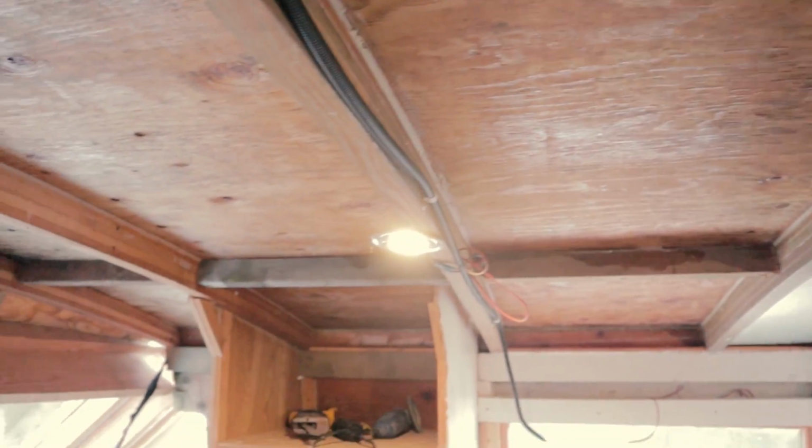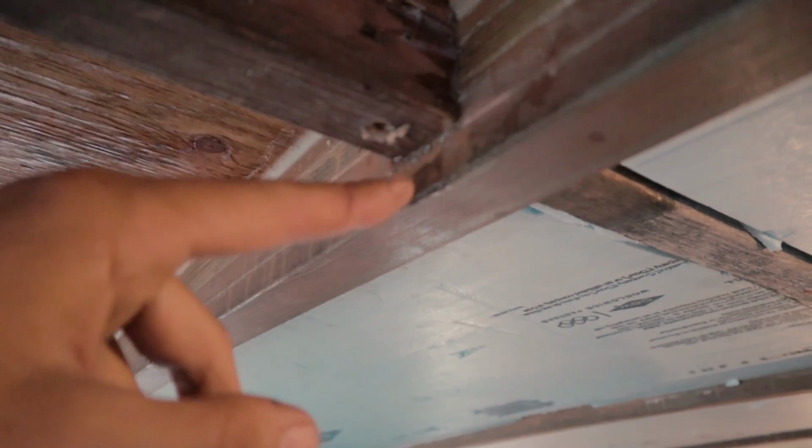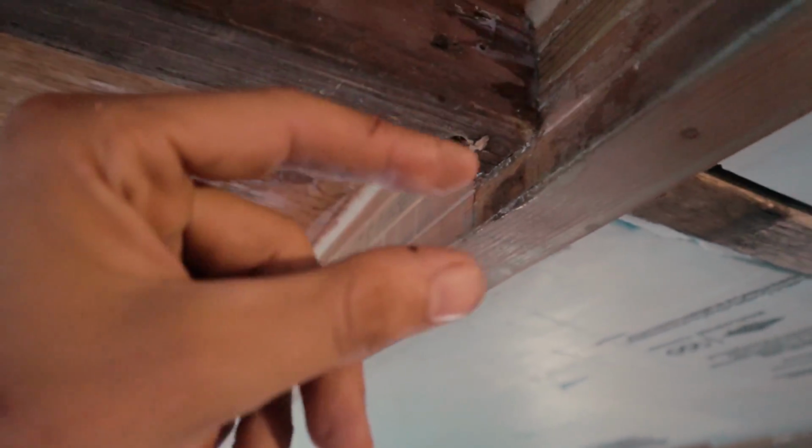Alright, look at that. It may not look like much, but all these little studs all the way across really strengthen the place up. Also, you can see there's the depth that we're going for. So we got the board in, and that's about 3/4 of an inch, so we're taking 1/4 of it to lay the board in here, and then we'll still have 1/2 inch of overextension. And if you think 1/2 inch ain't much, well, let me tell you, it's plenty for headroom right here. So when I'm standing right at the counter and working on a delicious meal, it does the trick.